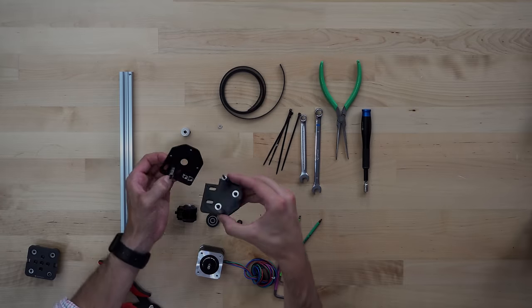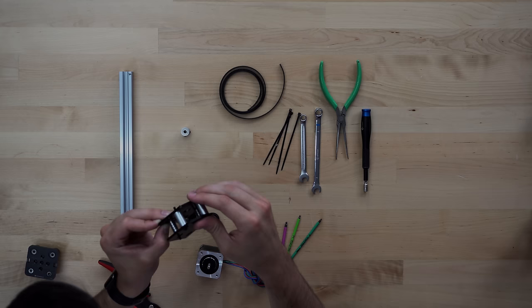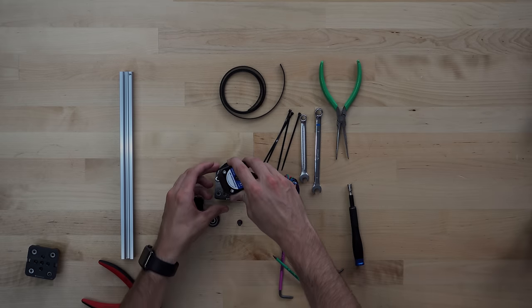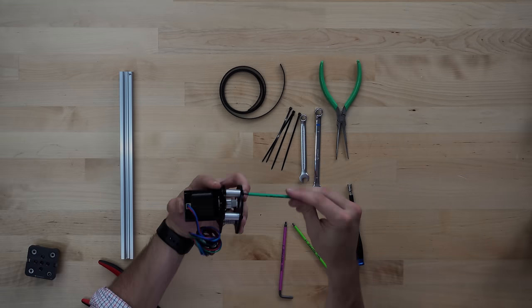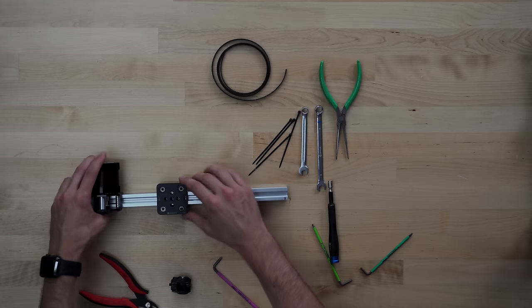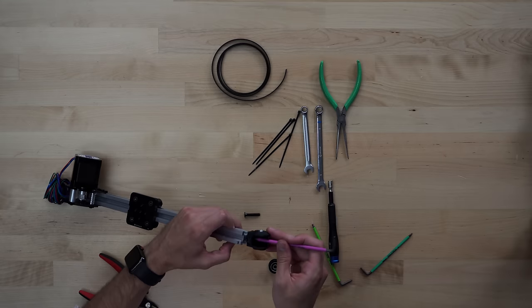What is interesting about the X-axes is the use of bearings to prevent the timing belt from rubbing on the edge of the rail, because as you will see, the timing belt loops behind the V-rail. While all the washers and bearings can be a lot to juggle when attaching the stepper motor, the routing of the belt behind the rail decreased the footprint of the axis, which is perfect for Zydex. It was important to keep the X-axes as light as possible because both Z-axes will have to lift an X-axis, hence why we are using the smallest V-rail.